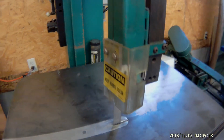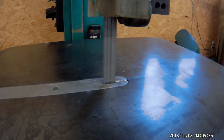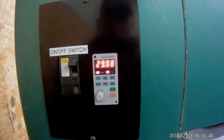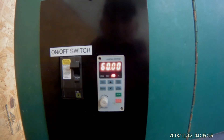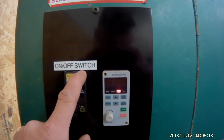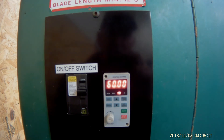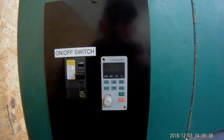It's kind of hard to tell that it's running, but it is running — it runs nice and quiet. Every now and again you'll see the seam of the bandsaw blade coming through. The other thing I want to point out is that I did use the original three-phase motor, because that's what you do with a VFD — you hook the three-phase motor to one side of the VFD and single-phase power to the other side. I push stop to stop the motor, and it has stops, so this is the mode it'll stay in as long as you have power to it. Rather than unplugging it from the wall, I put the power switch so I can just kill it there. They don't recommend killing power to the unit when the machine is running, and that's why I elected for a switch rather than an emergency kill switch. If you have any questions, let me know — I'll be glad to answer whatever I can. Thanks.